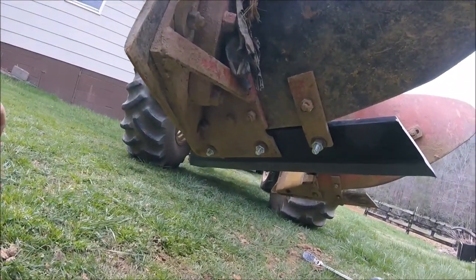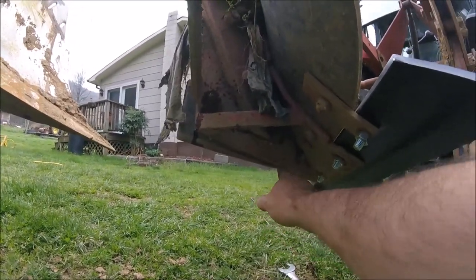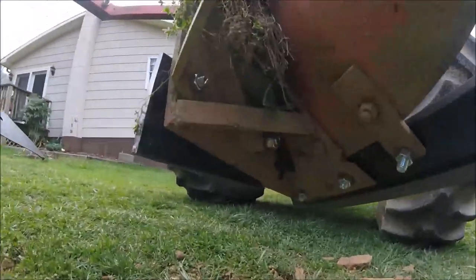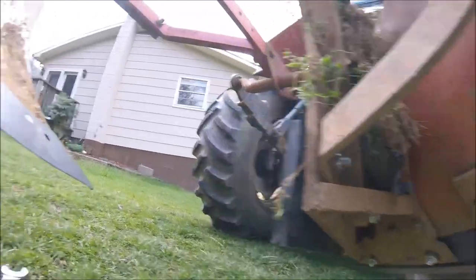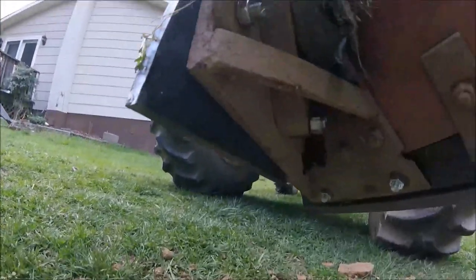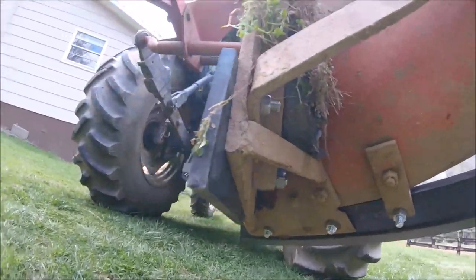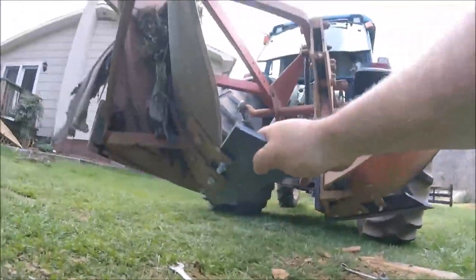We're making some headway. You can see right here is my landslide — it's not worn completely out, but you can see the difference in them. What happens is when that slide gets worn down, you start wearing the bottom of your frog here. This one appears worn a little bit more than the rest of them, but you see how much thicker the new one is.